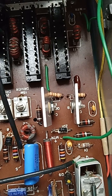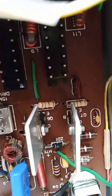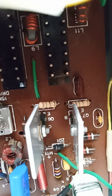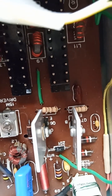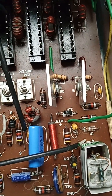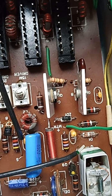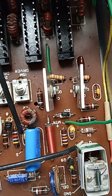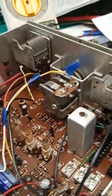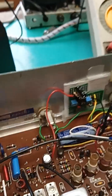What I found was that this was improved by taking out the original emitter resistors — see where the E is? They've got to be replaced with very carefully matched 0.15 ohm resistors. If they're not precisely matched, the power will drop. I added a 47 picofarad capacitor from the collectors to ground, and that brought the power up just a bit — it changed the tuning on the collector. It's up to a watt and a half now, which ain't bad. If you've got a good antenna, you'll be able to work DX with that, because I can work it with less.